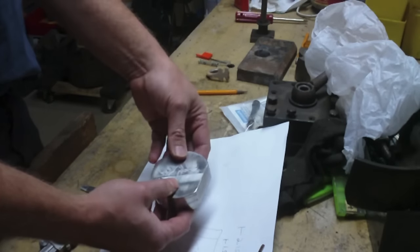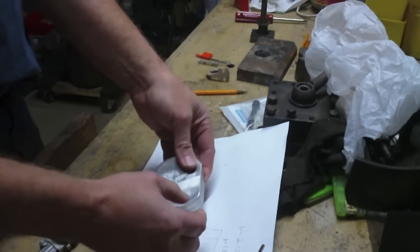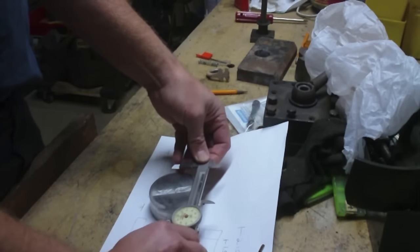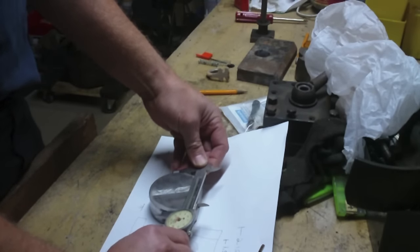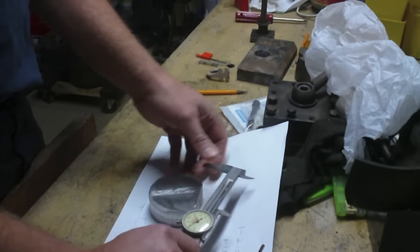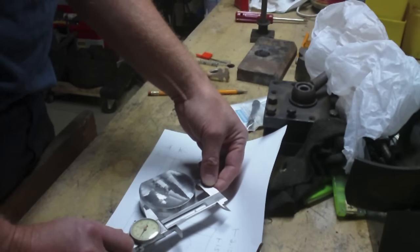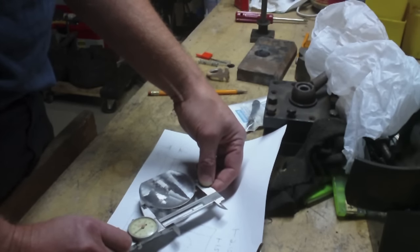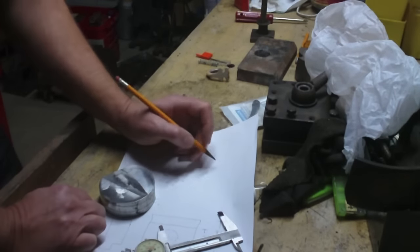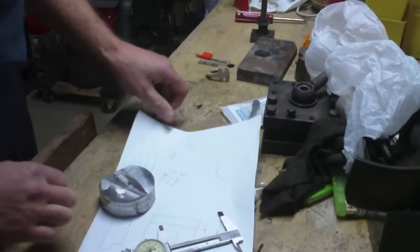I started cutting off, and I took some off already, and I don't know how much I took off. But it's easy enough to figure out because this is round. I could take the dimension that I started with, which looks like it's going to be, now there's a burr. There's a little bit of a burr on the edge there, so I got to take that into account. Yeah, 320 thousandths seems about right. So my starting dimension is 320. What did I say? 320 thousandths? No. It's 3 inches and 20 thousandths. Yeah, that wouldn't work. Okay.